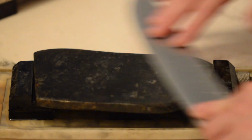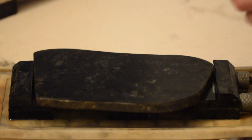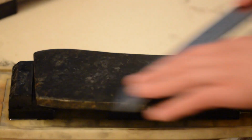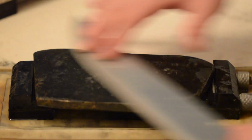And as it gets the cutting action going in the stone, you get a feel for where your edge is. And I really like sharpening convex edges like this because I'm feeling it out that I'm on the right plane. And I can real easily check by sight and by feel how sharp the edge is, and then those spots that I want to work, improve.